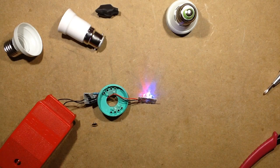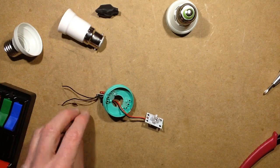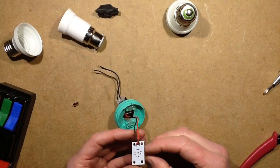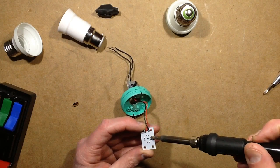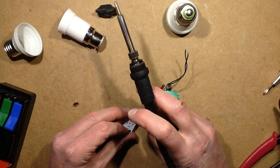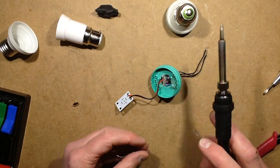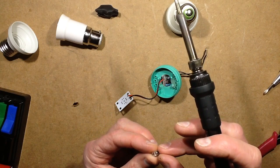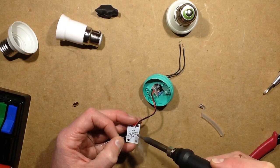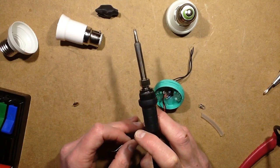This meter should be well protected though — it is category 4. So let's remove the rogue LED that I don't want. I'm going to use my usual technique: a bit of silicone tubing, just jam it over the end of the LED, melt the solder joints while pulling with the silicone tubing, and that's the LED out. Then clean up those pads with a fresh bit of solder. I notice that the flashing LEDs tend to have the colour chips mounted not dead centre — they tend to fire out at a bit of an angle. I should have looked that LED out before I did this.